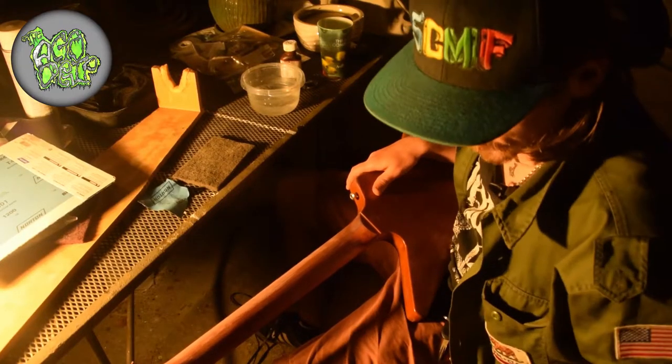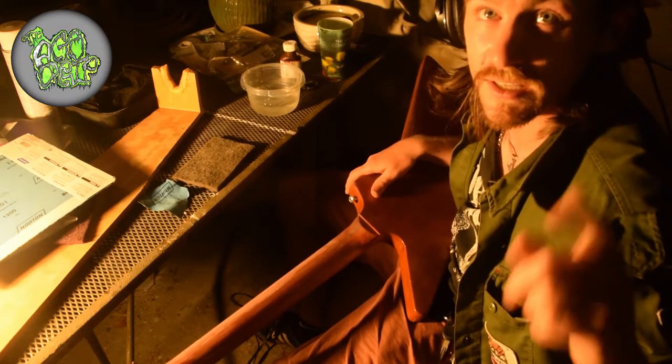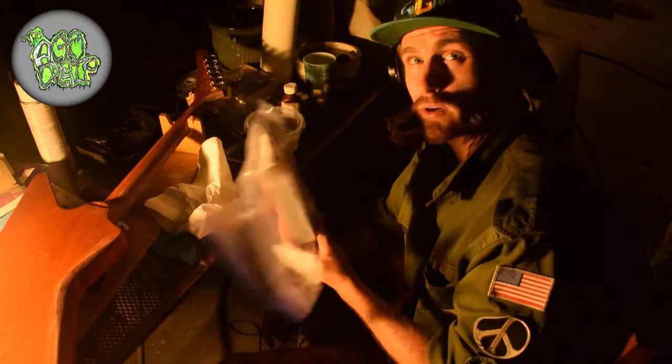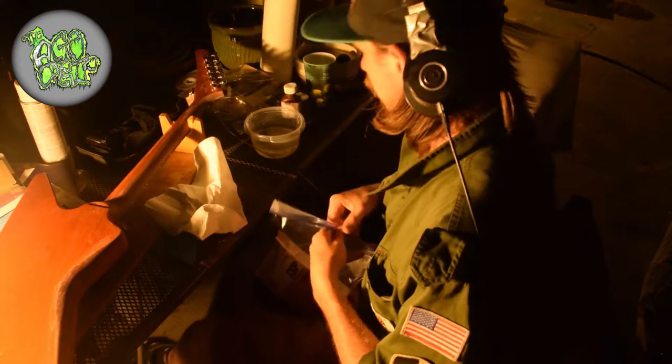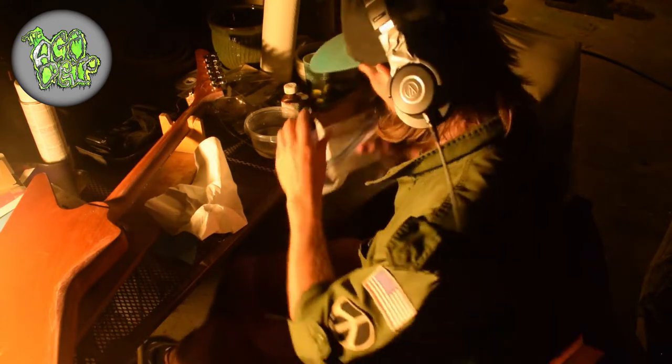What we're now going to do is very lightly clean this with a bit of TSP - trisodium phosphate. I'm going to grab the TSP and come back and we're going to use it very quickly and lightly. That's going to help me get all the crap out of the grain, and then we're going to hit it with the finish again. Now I've got the trisodium phosphate and we're going to just scrub this guy down. I'm going to pour a little bit more of it into the Tupperware - we're done with the wet sanding.